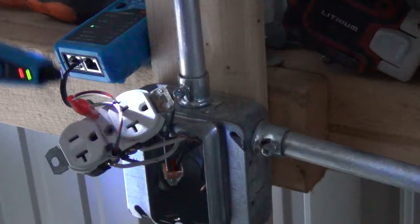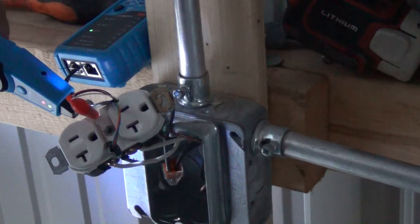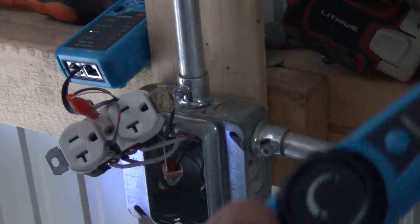There's a metal contact at the end of the probe. You can hear it trace the wire but it's very faint — but when you actually make contact, it's nice and loud. We're going to go over to the box and locate the breaker.